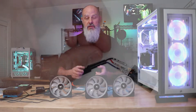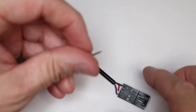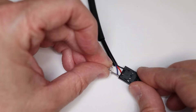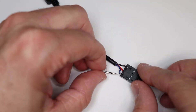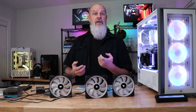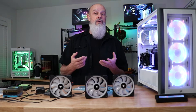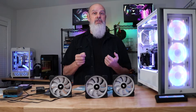Once you have all three cables with a new pin connector, you do have to be kind of delicate — these pins bend easily. When you insert it into the connector, the barb just goes up; slide it in, work it a little bit gently, and that barb will connect and prevent it from coming back out. If you need to remove it, just take a small pin, push that barb down a little bit, and it should slide right out.